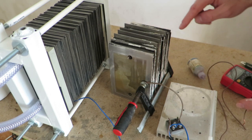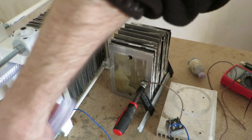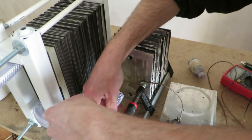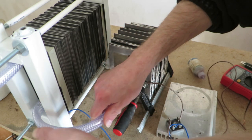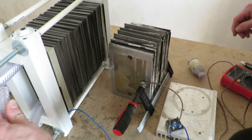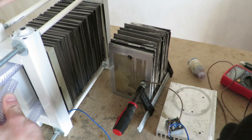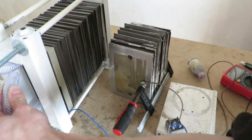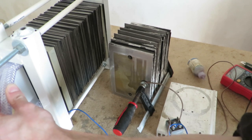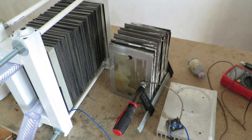Also, you don't really want to make the water connection directly from here to there like this, because then this water will be conductive and will be shorted effectively, so this part will be heated quite a lot. So I'm basically making it so that from there it will be long hoses to the main water reservoir, and therefore the water resistance will be quite high.